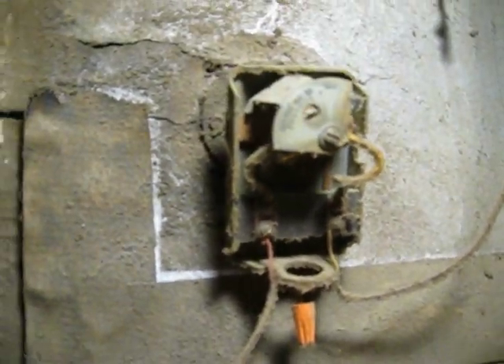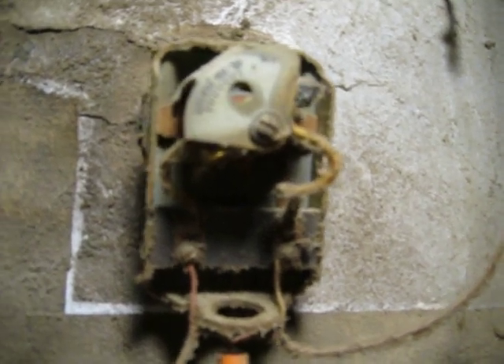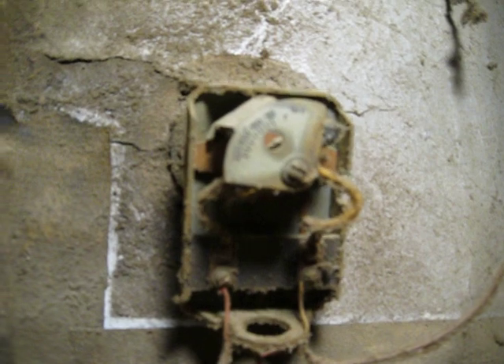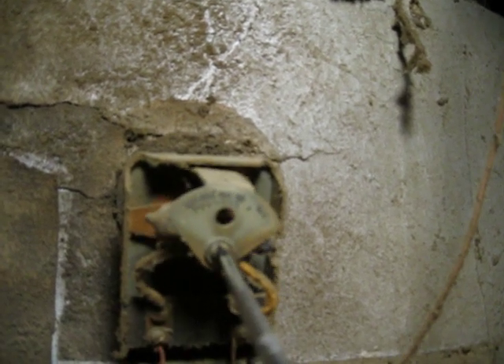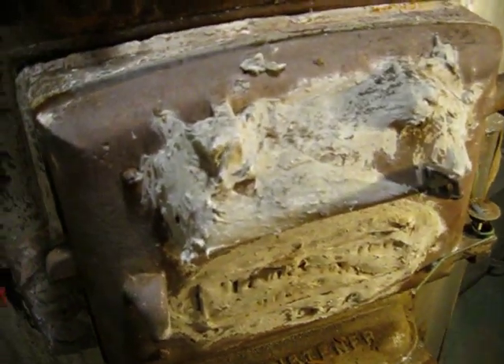Going up here, there's a secondary controller of some kind. I haven't figured out exactly what it does — I think it might be something that looks at the flue gas temperature. But I know it's got a mercury tilt switch in it, and if I go like this, a little pilot light clicks on. You hear that gas? You hear that thing fire up? And now a little window into why these things are so inefficient.